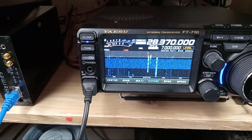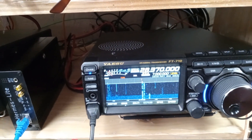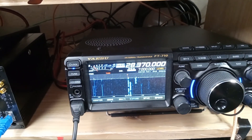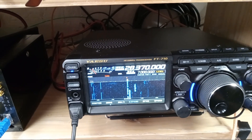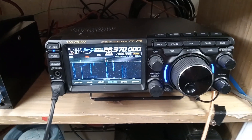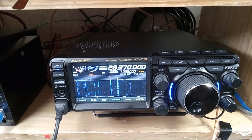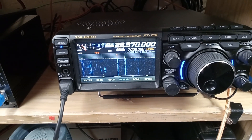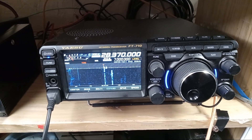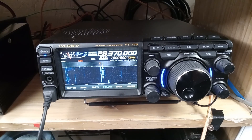That's the long wire. It's been raining here. The vertical — there's a little trade in the QSB. Sometimes the long wire will fade in at a little higher signal and the vertical will fade out a little bit, but mostly the vertical has equal or higher signal depending on the location of the transmitting station. We've had astronomical amounts of rain. In the last 24 hours — that's my telescoping flagpole antenna with an 11-foot add-on to it. Hope that helps. We do live on a hill here.